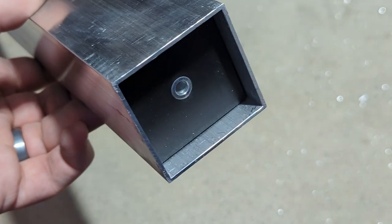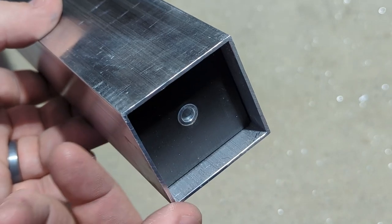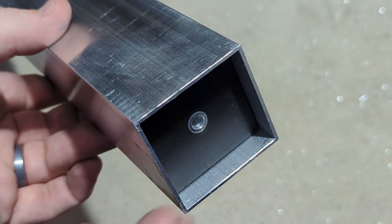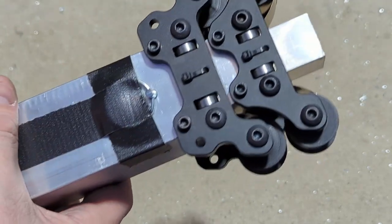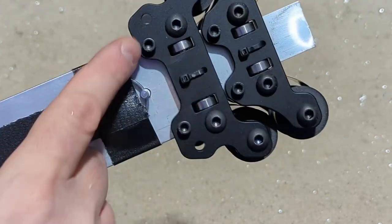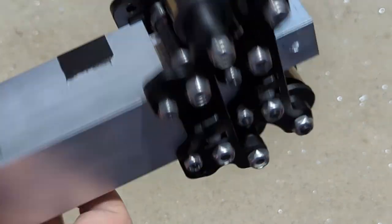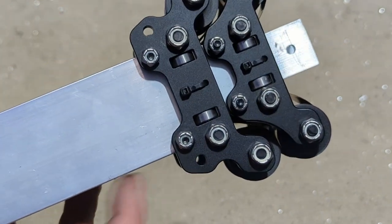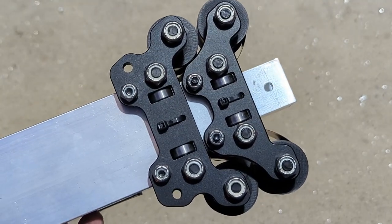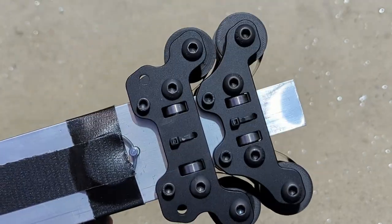So when you go to implement this into your robot, make sure that you're leaving an extra inch or two on your base stage, especially at the bottom, so you have some mounting points there. The other thing that this has on the base stage are some additional holes that are able to be tapped for 1/4-20, but they're really number 10 size holes that you can attach things to. So you can do some triangles down to your structure just to make the whole thing more rigid and more stable, or integrate it somehow into your robot that way.